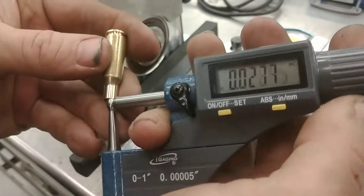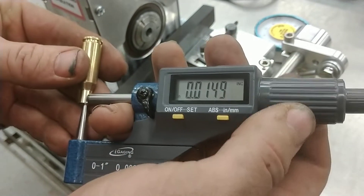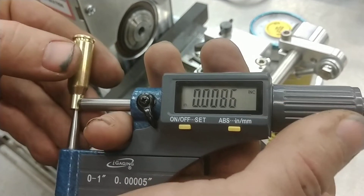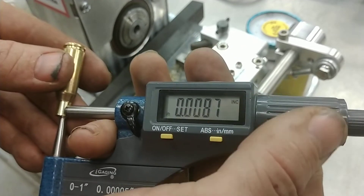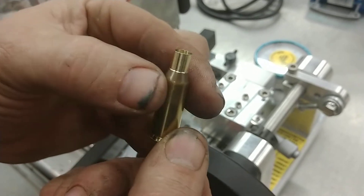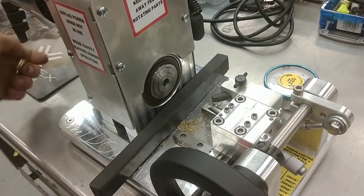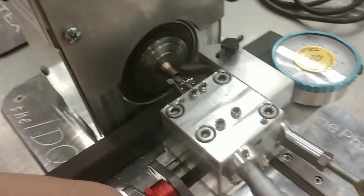Just a nice tap. You can see the finish here - you've got a good finish inside and outside cleanup. Let's check our thickness. You guys are generally turning in the 8.6 to 8.8 range. As you can see now, that's one pass and we've got sufficient cleanup inside and outside, good finish. I'll run another one here. Take your swab - on the PPC or the 220 Russian, I would swab each time so you make sure you've got a good concentric bite on the case.